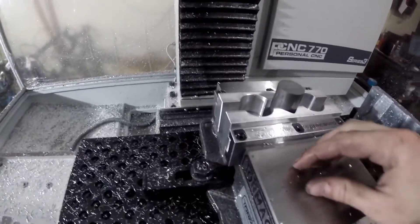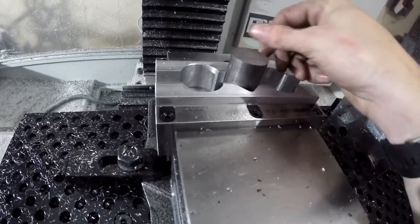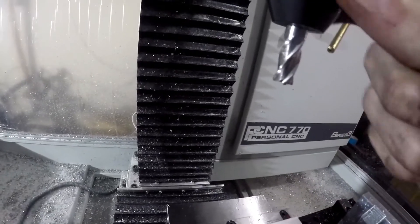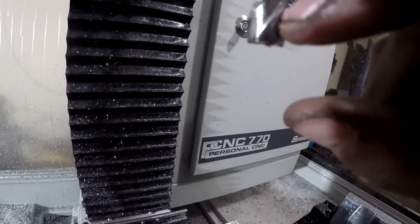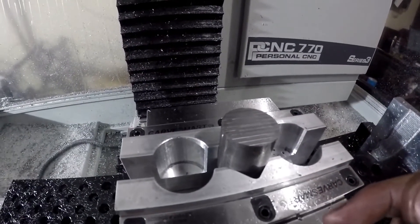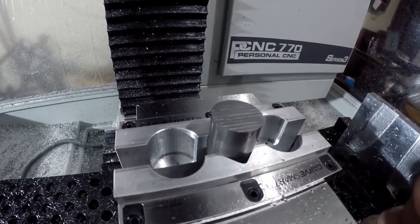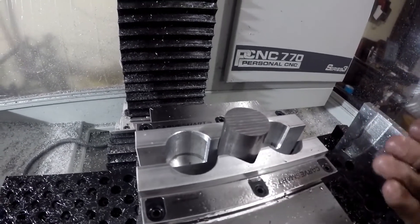After the first cuts on the mill with steel, you can see these little brown things. I just faced this off, it was maybe 0.1 inches deep, so it wasn't terribly bad. It started sparking at the end — this is only a high speed steel mill and it's three eighths — and I totally roasted it. You can see the burn marks right there, that's probably not good. It probably didn't help that I was going both ways, climb milling then conventional milling. On a CNC machine you always want to climb mill, so I'll stick with climb milling when I do steel.